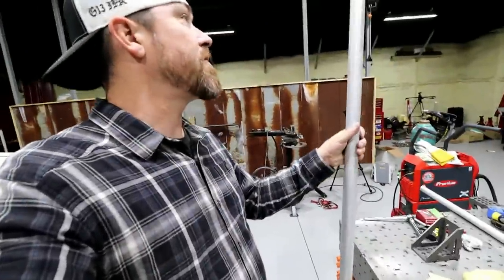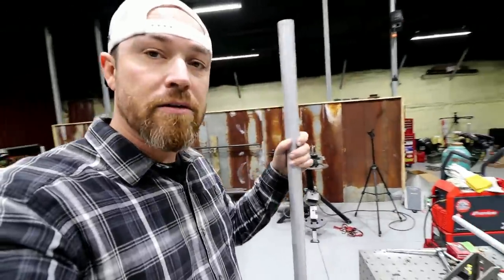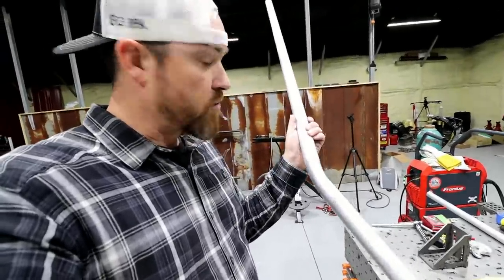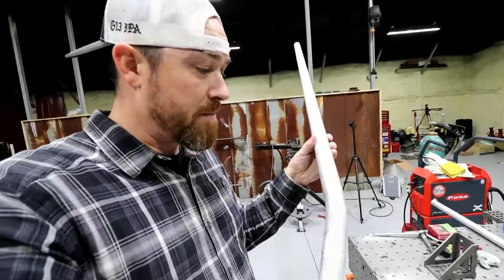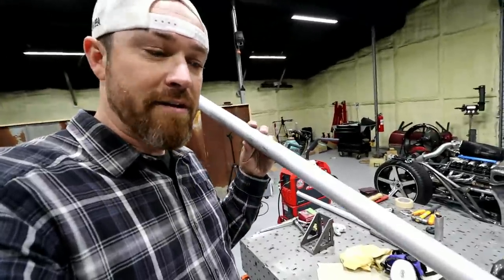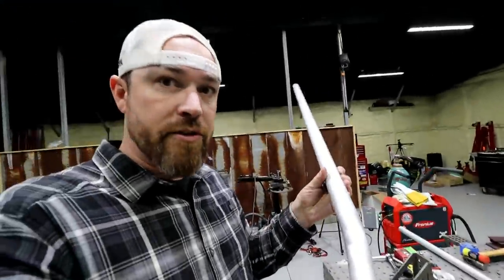If you may, just put this in a little separate video — if you're looking to bend aluminum tubing and have questions about bending it in a roll bar style bender. You can get away with at least 22 and a half degrees. I think you could probably keep going; what's happening is this alloy is so strong that instead of cracking the outside, it just puts a wrinkle on the inside.